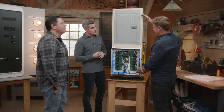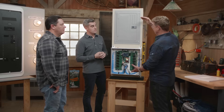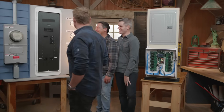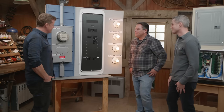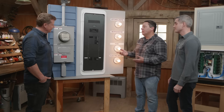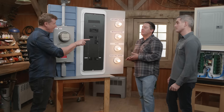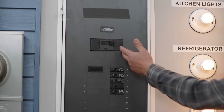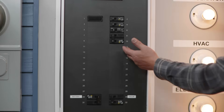It's not all in one panel though, so it is a little bit of a bolt-on as opposed to an integrated solution. Do we have integrated solutions these days? We do — you've got one right behind you. So if you're doing a new installation or a panel replacement or an upgrade and you know you're probably going to have solar or battery, something like this is the way to go. All of the smarts that are over there are already built into the background of this panel. This panel wires like a conventional panel would — you'd still bring utility power in, you'd have your battery down here, your solar over here, and your regular loads like the kitchen lights and the refrigerator. But it also has all of the smart technology built in and ready to go.